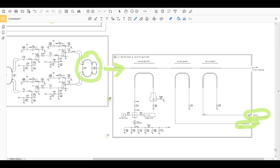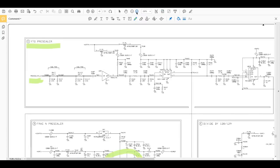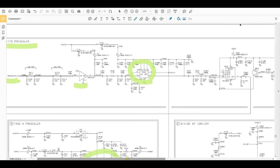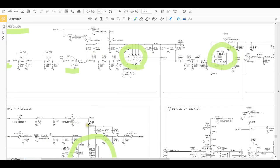The LO to pre-scaler goes all the way over here to the LO pre-scaler section. Like last time, we have a 4 dB pad and another 4 dB pad — two attenuators — then an RF amplifier, then the divide-by-four that was faulty in the previous unit I fixed, then a divide-by-two. Following that are components I may not be able to replace. We have plenty of places to measure, and they'll match one-to-one with this block diagram. Let's go ahead and look at them.